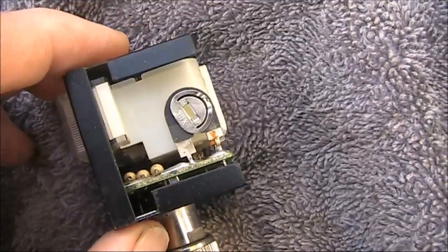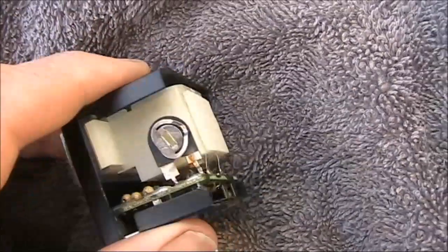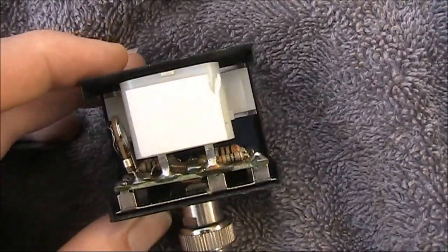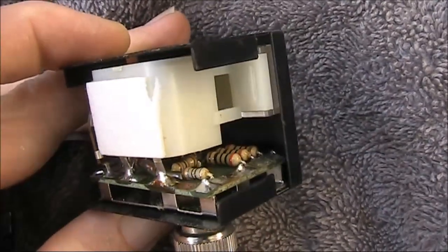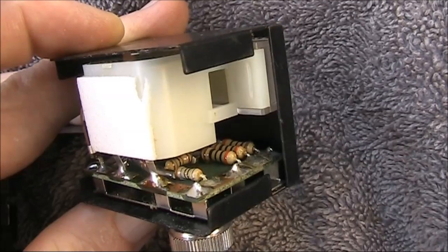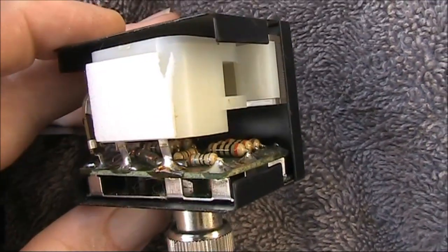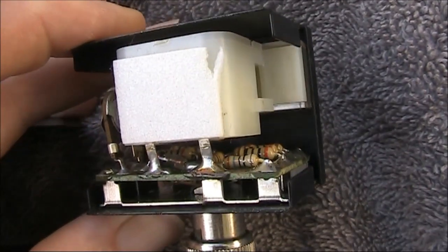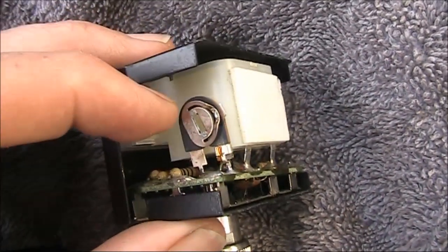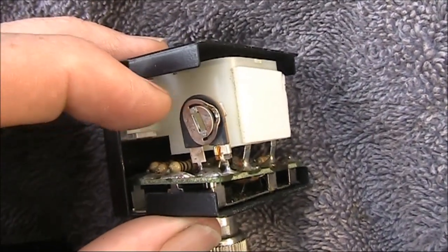Having a look inside — I've removed the back cover. It's pretty simple: just a meter movement. There's a whole lot of resistors in there. Some of them would be in parallel for the dummy load. You might be able to see a diode in there and a potentiometer. So this might actually just need calibrating.